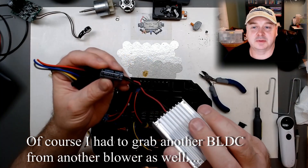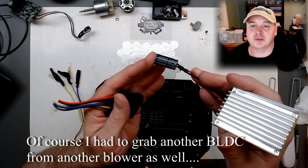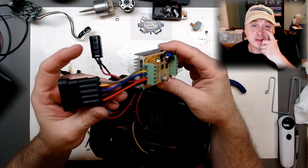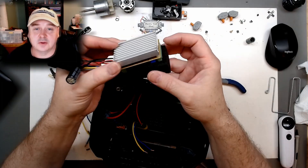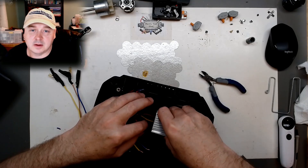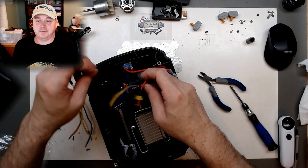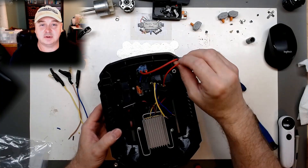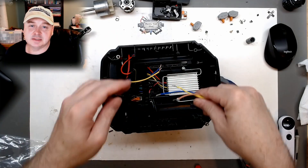I just clipped the 50-volt capacitor off and I'm going to put the 63-volt capacitor from the EGO blower on the bus, tied into the same 56-volt input. We know that 63-volt cap is good enough for the BLDC and the EGO blower. We've got our connector ready, pot turned down, foam pre-cut for cushion, and we lay it in with the wire over the heat sink just like before. My backup plan was always the 50-volt controller — I do like that little controller a lot. I've also got a 20-amp fuse tucked away. All I've got to do now is attach the motor leads.